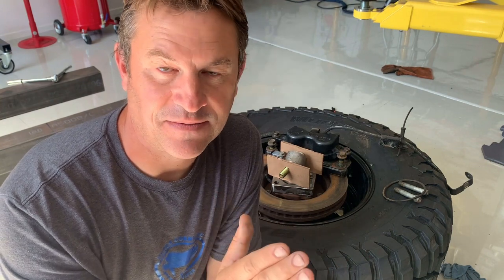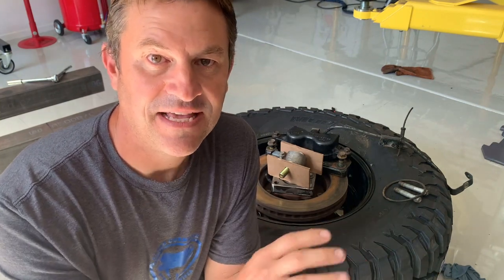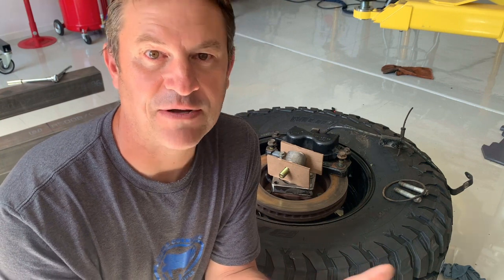Now that the plasma table is going, I'm ready to start cutting some parts. I would really like to start cutting the A-arms so this thing starts coming together. But I have to know what those are connected to, so I kind of have to start at the extremes — my fixed dimensions, which in this case will be the spindles. Once I have that thing designed and put together, then I'll know how long to make the A-arms, and then I can change those at the chassis side. Let's go ahead and take a look at what I'm doing with the design and how having the parts together is slightly changing the way I'm going to build the spindle.